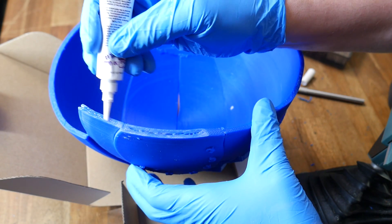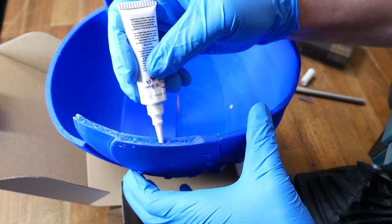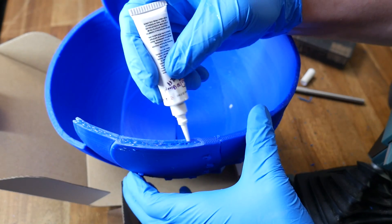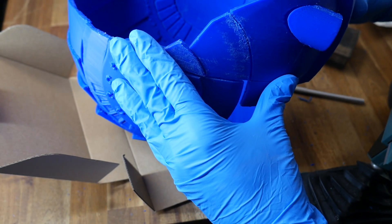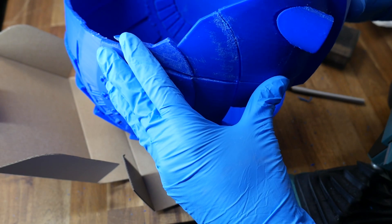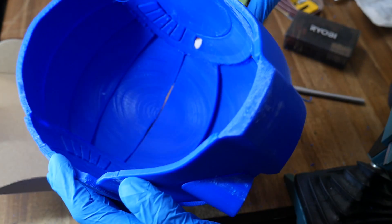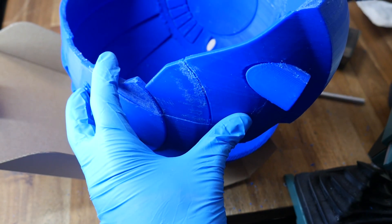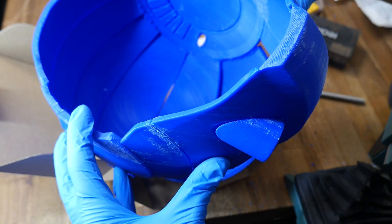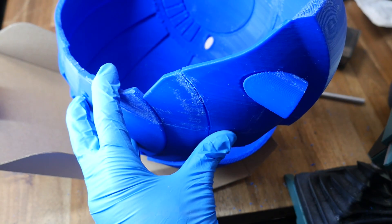When all of this was done, I broke out the glue version of the 3D Gloop. After sanding the two mating sides with 100 grit sandpaper, I applied a decent amount but not too much, before carefully mating the two halves together. It's meant to grab really tightly in only a matter of seconds, so you need to be very careful and precise with your placement. Clamping was impossible for this shape, so I held it in my hand and pushed it together hard for around 10 minutes.